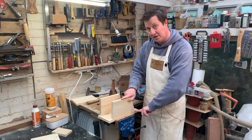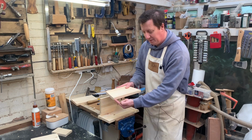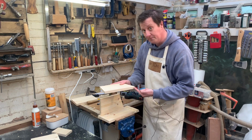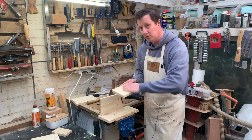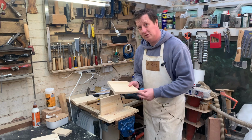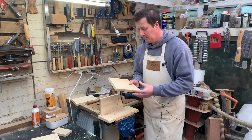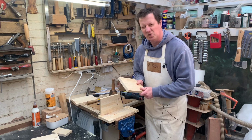for these to be measured off to. I'm going to screw them in from the underside, and I'm going to put a bead of wood glue along the edge as well. Make sure it's exterior grade wood glue, that it's suitable for outdoor use. Not so much for sticking purposes, but to actually give it a bit of a seal so it doesn't even get little drafts inside there.